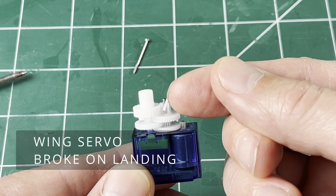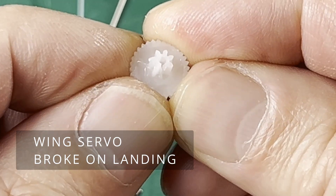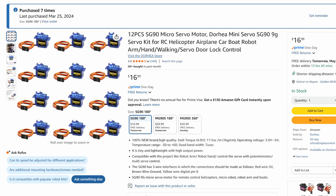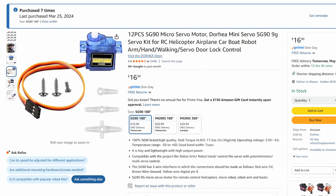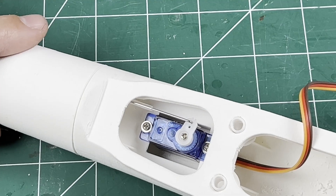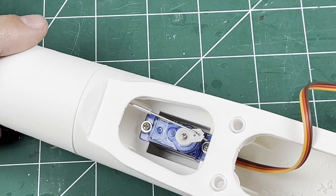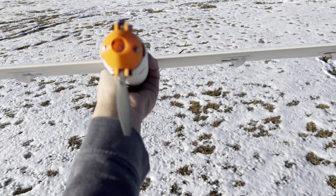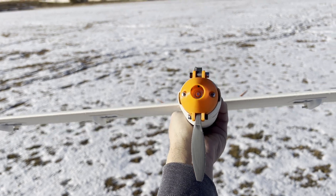Plastic gears can be kind of weak and it's not uncommon for one not to work right out of the box. But for under $1.50 each they can be a fun option if used right — keep the servo arm short and you won't notice the lack of precision. For an inexpensive lightweight build they seem to have plenty of torque.